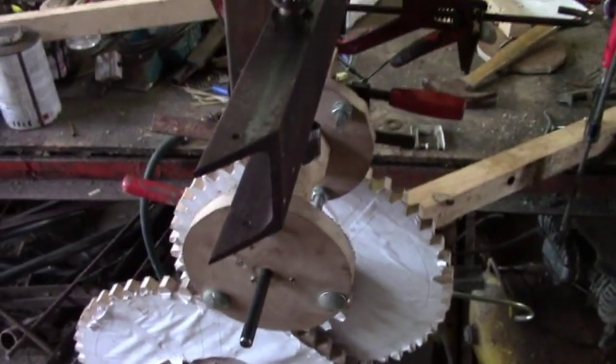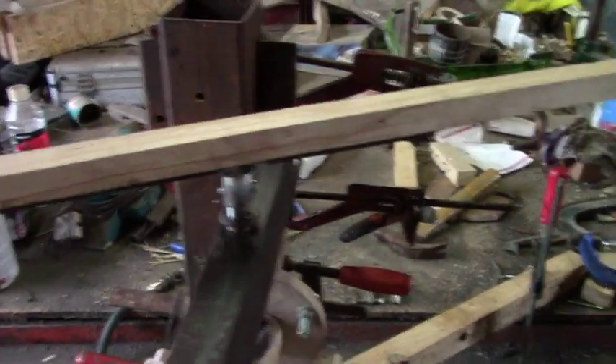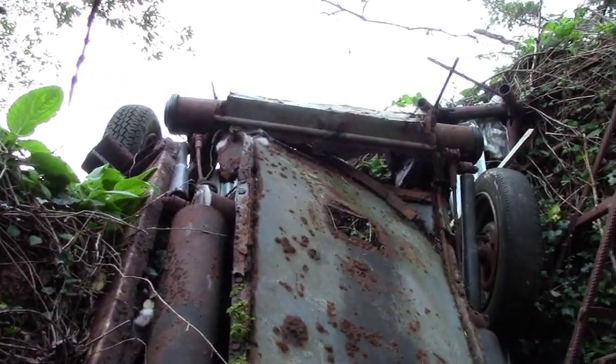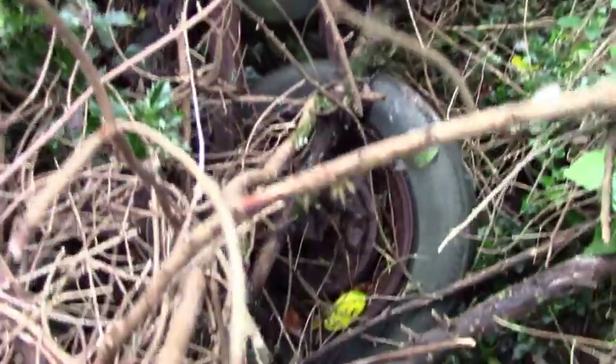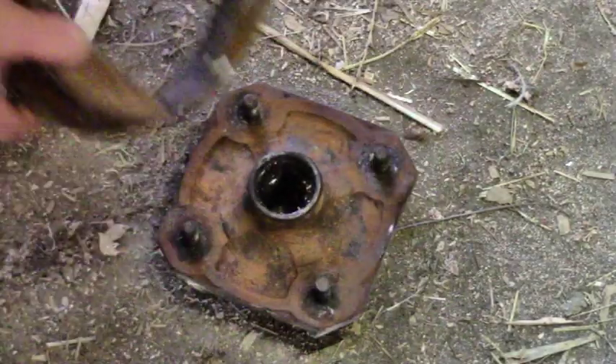It turns out I'm very good at being a heavy weight, but the cog wheels had to be able to take my weight, and especially the bearings. Luckily there's a hedge not far away that has old cars dumped in it. I cut two wheels off and used the stub axles from those — even though they must be 40 years old at least, the bearings were perfect. I cut away some of the brake drums to lighten them.